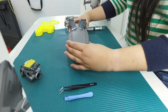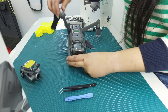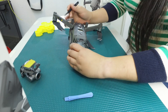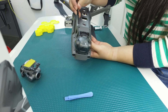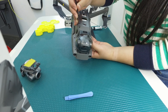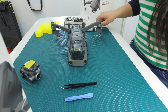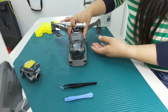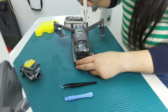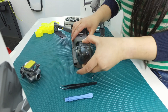So we have the drone here and we're going to turn it on its back. Put these two legs out of the way and you're going to take your precision tweezers — this screw here on this side is going to have a bit of a gel-like piece in there, so we're going to take that out. Now that we have that gel piece out, we're going to take our hex 1.5 driver and remove these two screws, one and two. Once those two screws are removed, we're going to remove the gimbal lock and set that aside.